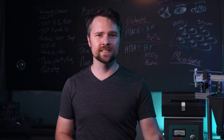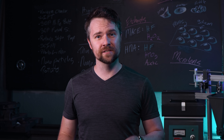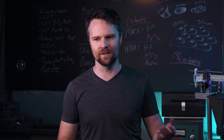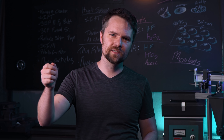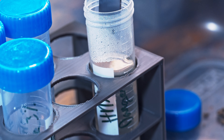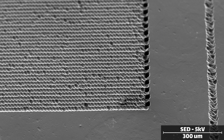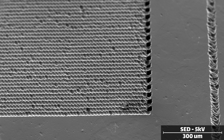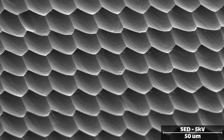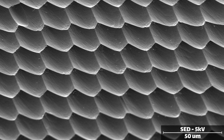Because this was such an unpleasant set of liquids to deal with, I don't have a lot of footage. But it's very straightforward: you run the laser protocol to get the ablation marks, throw it in the HNA for some period of time, and out the other end you should get a nicely etched surface. I let it etch overnight just to see what would happen. We get some really deep etchings — all of the laser marks are extremely smooth, have very low surface roughness, and have etched pretty deeply from the original starting point.